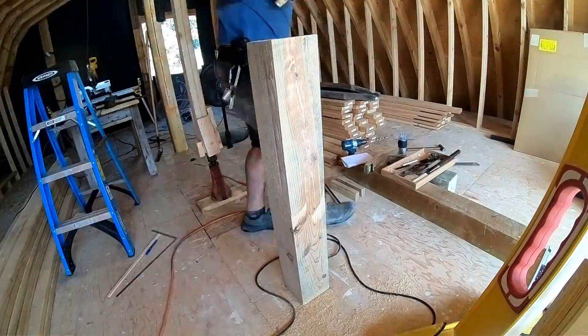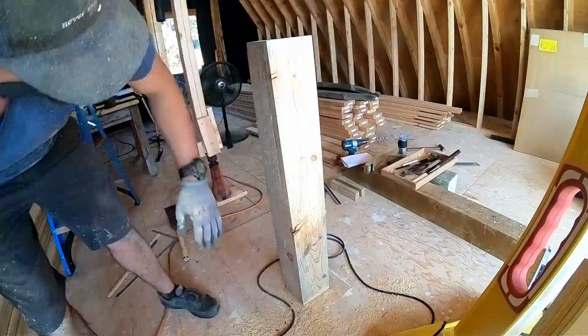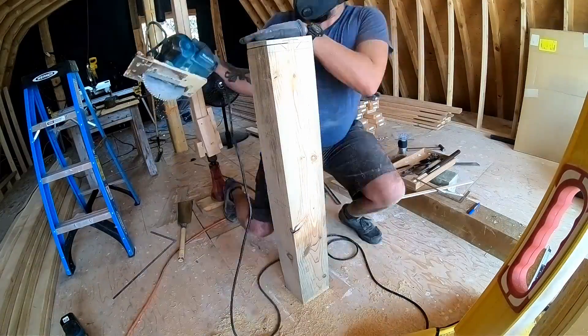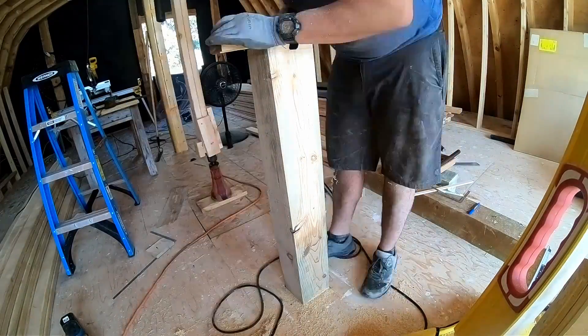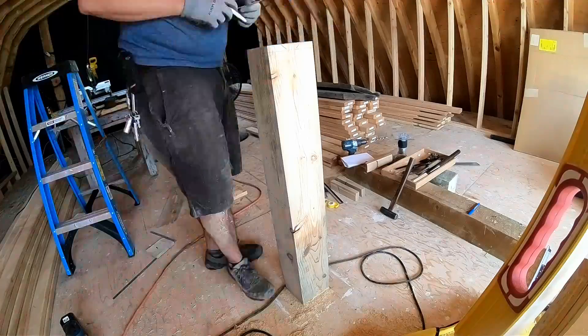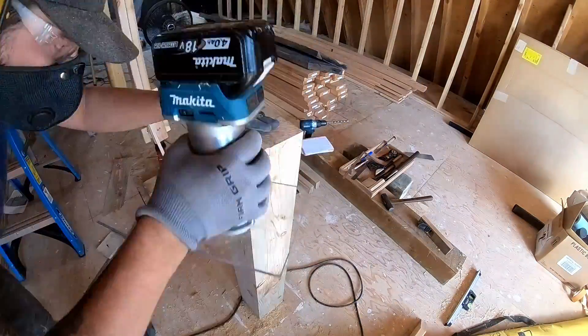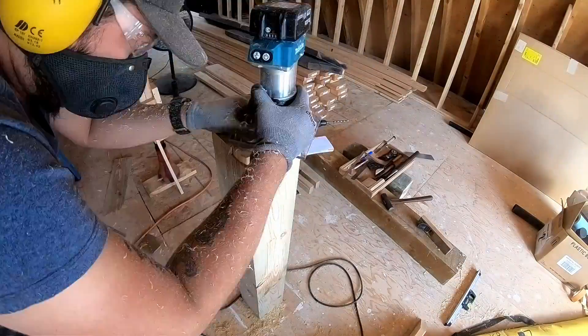What I'm doing here is I first cut off the extra part of wood from that curved post to square up the post, and then cut all the rest of the joinery. It is a lot easier to cut this joint on the part that you can put on sawhorses than it is to cut the piece that's sticking up in the air.